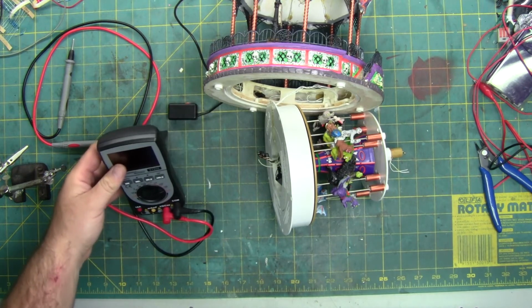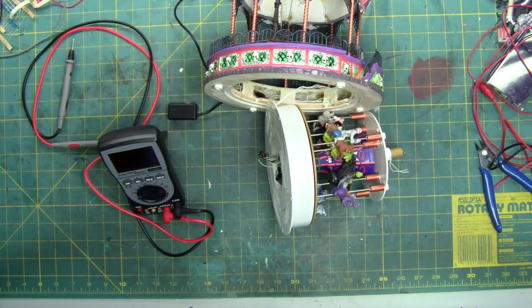on a front yard scene, and the front yard scene, the LEDs had shorted. A lot of times when LEDs pop, they open, so there's no more path for electricity to go through, and the LEDs were shorted, and it was pulling a lot more power than it was supposed to, which caused the LED to burn. And I mean, it burned, it smoked, and it burned right through the bottom of the front yard, which I believe I showed on one of the previous videos, the repair on that. So, similar process, tracing it back, finding out what failed. I can't imagine an entire string of LEDs failing, but it's first time for everything.